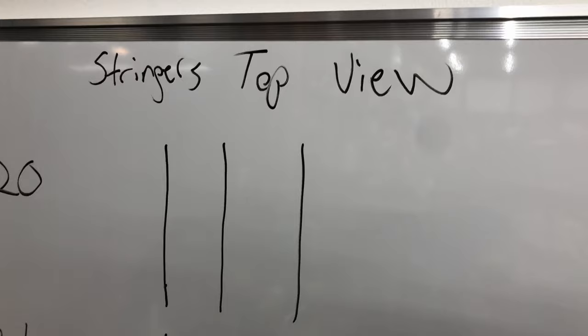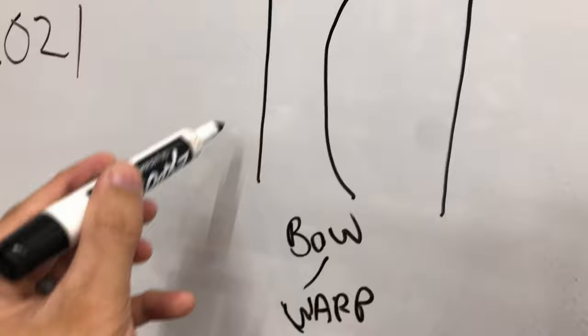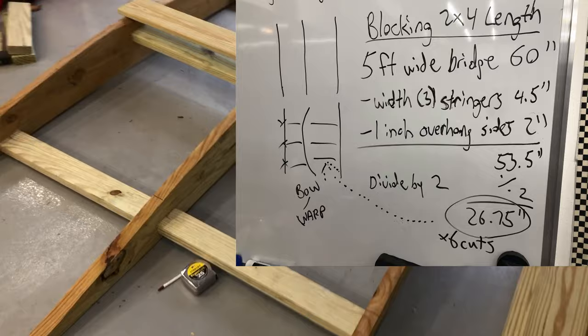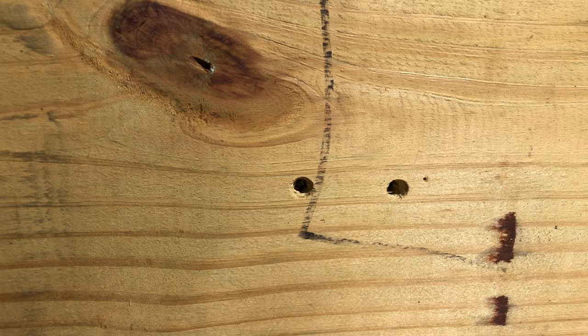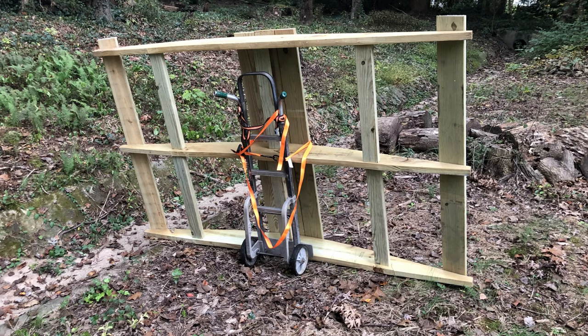In my opinion, the hardest part of this whole project was lining up the three stringers. I had a five-foot bridge, so I needed three for center support. I waited a year due to the lumber shortage, so by the time I got to assembling this bridge, they all dried a little bit differently. The best thing you could do is to measure a set distance on each of the stringers — like 2 feet, 4 feet, 6 feet — mark it, and then when you do your blocking, the 2x4 blocking, just line it up that way. In this picture you'll see that the blocking is flat, but the usual practice is to have it standing up. The reason why I have mine flat is because when I'm screwing the deck boards from above, I don't want the screws to get in the way of the screws used in the blocking.